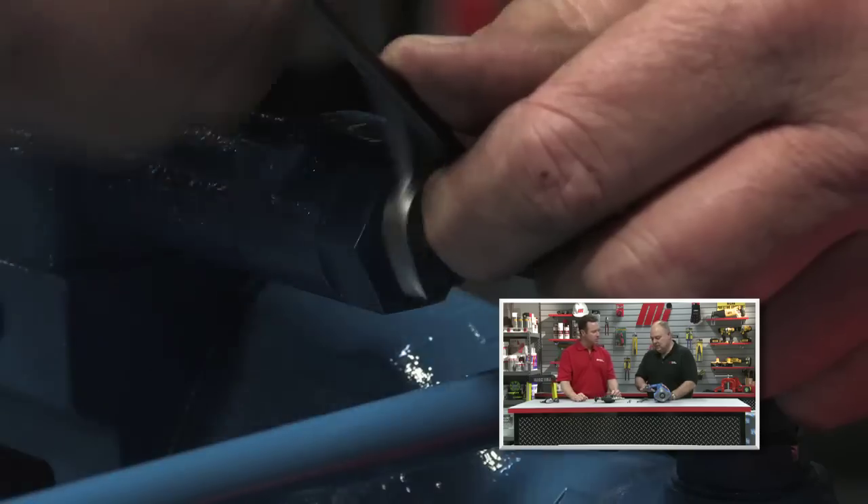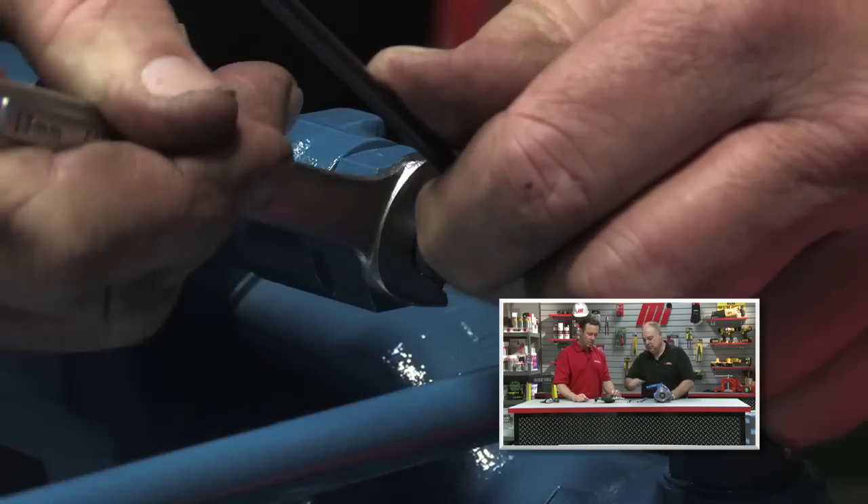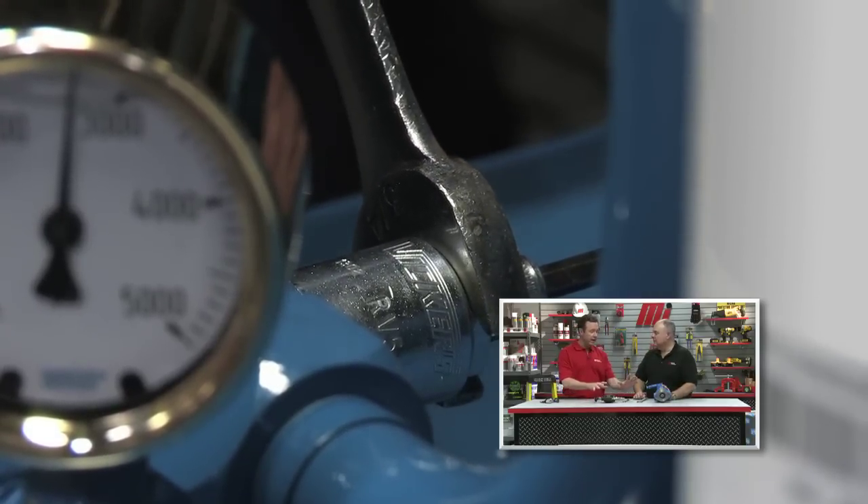How do we finish everything up so they're all working together? The last thing we do is complete the setting by locking down the adjustment nuts on the pump — we've got these here to lock them up. But we don't do that until they're both working with maximum energy savings. That's correct — that's exactly what we're looking for.